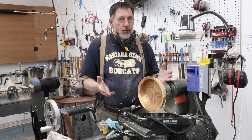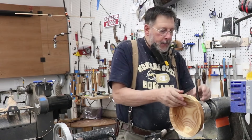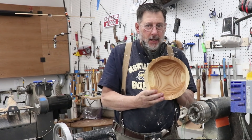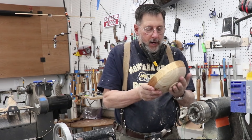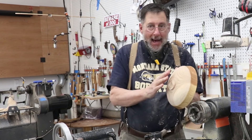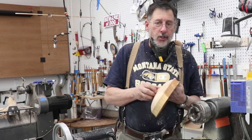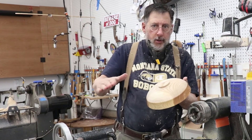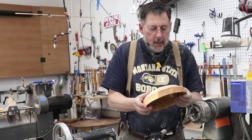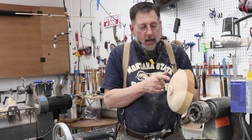I am ready to reverse this and deal with the bottom. Let me take this out of my chuck jaws and show you what I have. I've got the inside completed — it's sanded and it's got some finish on it. I don't see any torn grain — this is a nice bowl. The back needs to be dealt with. I plan on taking this tenon off completely, and I've got videos discussing compression fixings and expansion fixings. All I've got to do at this point is turn that away. I'm going to put this back between centers on my other lathe and true up this area, sand it, and finish it.